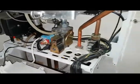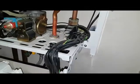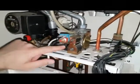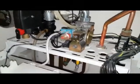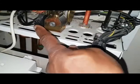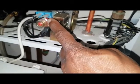Alright, so we'll do some parts identification. Let's see what you can tell by what you can see. If you point things out, what you know. Gas valve. On a gas valve, see this here, you've got two connections, this one and that one. This is your 240 mains for your main gas valve. This is your low voltage for your modulating coil.